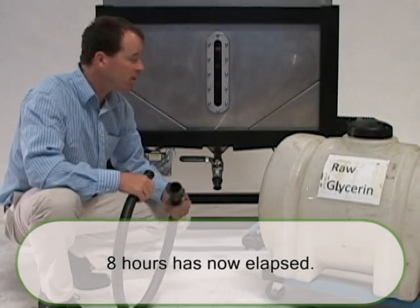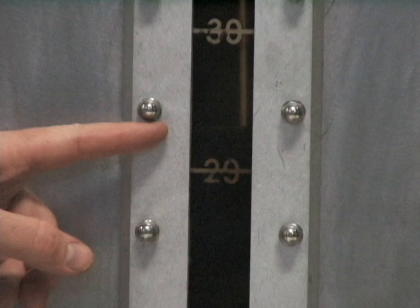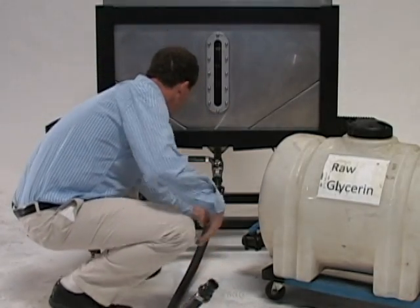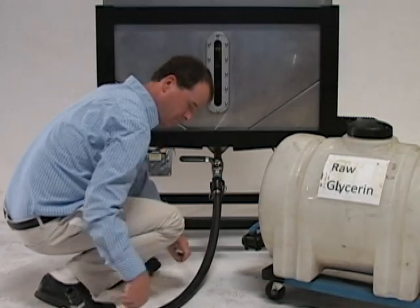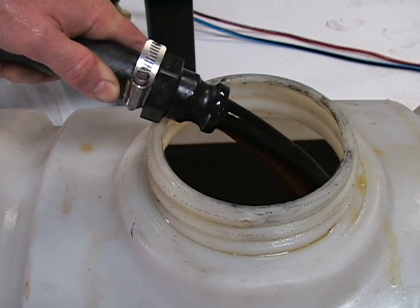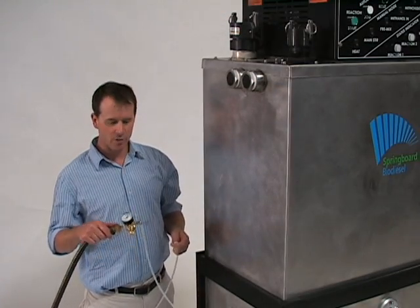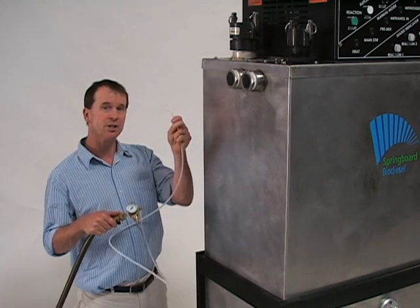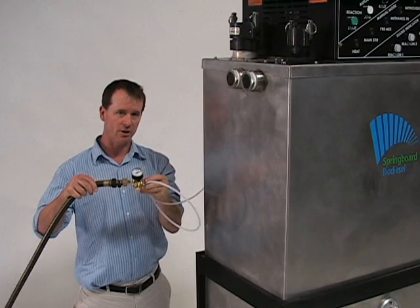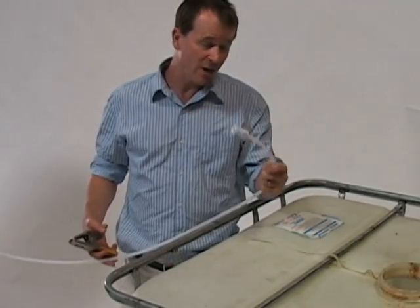It's been eight hours now, and what we're going to do next is drain off the glycerin. We should have between 20 and 24 gallons of glycerin that you can see through the sight glass. We're going to drain it through the ball valve and then go into the wash cycle. The glycerin will be a lot darker, thicker, and more viscous. The 380 comes standard with a pressurized water kit — you hook one end into the machine and the other end into a standard garden hose. Water out goes in here, and the other end goes into your collection container.